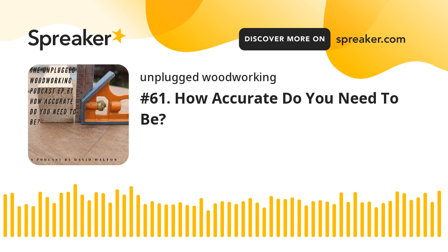I kind of laughed at it, probably for two reasons. One, I laughed because it's not square. And I kind of laughed thinking that once upon a time I would have actually made that perfectly square — 100% square — but it's not needed. So obviously this is where this episode comes from: how accurate do you really need to be? With the leg being out of square, it doesn't really make a difference, because those legs are going to be hexagonal and also going to be tapered. So there was nothing to gain by planing them 100% square.